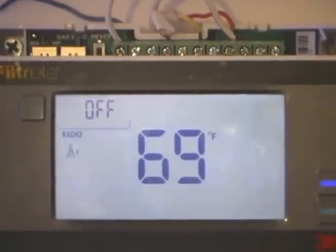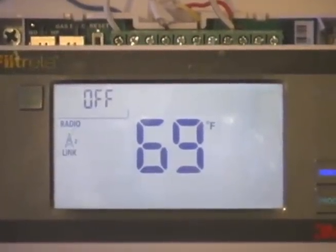You may already have a wire in the RH from your furnace — that is okay, it will just be added to it and will not interfere. So you will have one in the RH and one in the C. At that point go ahead and plug it into the wall, and this will supply power to your thermostat.